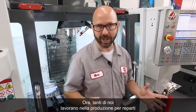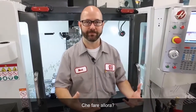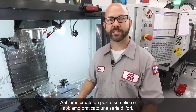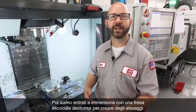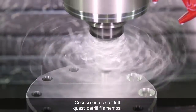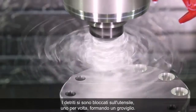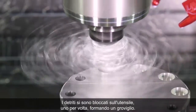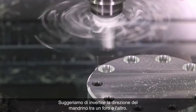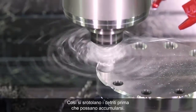Now, a lot of us are working in job shops, and we just don't have the time to wait for new tools. What do we do then? Well, we're gonna program our way out of this problem. We've created a simple part and drilled a series of holes, then came in with a right-hand helix end mill plunging to create some counterbores. Now, this created all kinds of stringy chips. Those chips got stuck around our tool holder one at a time until they built up into that rat's nest. What we're suggesting is that we actually reverse the spindle direction between each hole — this is gonna spin off those chips before they have a chance to build up.